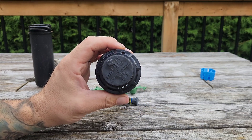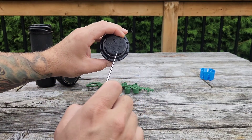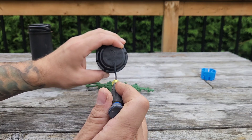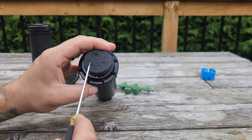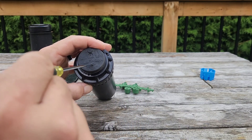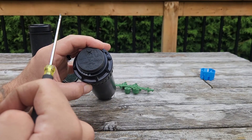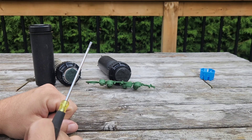This is the full circle model. To adjust the arc, stick your flat screwdriver or Rain Bird adjustment tool in and look for the plus or minus markings to increase or decrease the arc. These are fixed left-stop sprinklers — the left stop is not adjustable. You're adjusting the right stop: turning clockwise increases the arc, counterclockwise decreases it. Let's get these on the test pipe for some real demonstration.